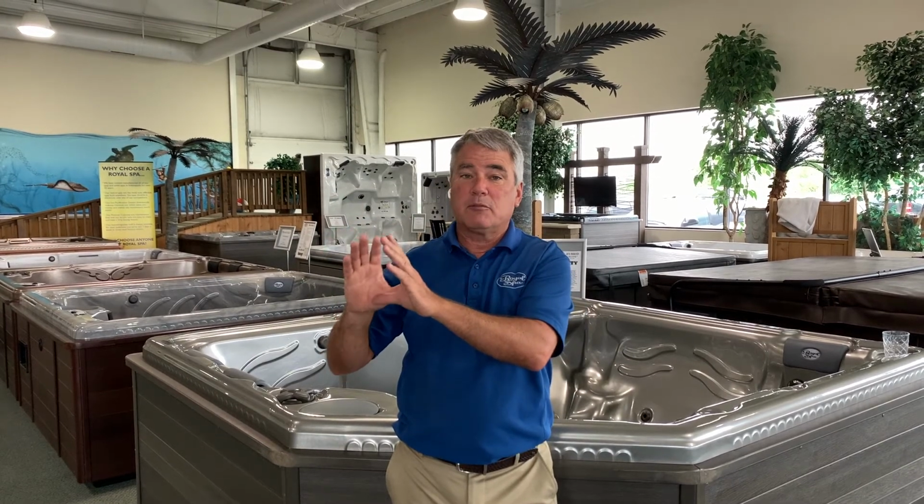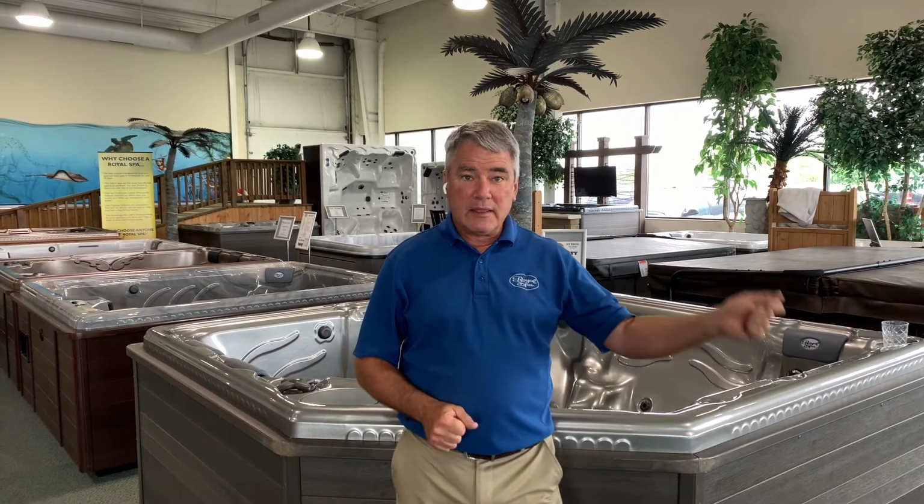Additionally, we're looking for a wire. We don't carry wire on our truck. So when we get there, we're looking for a disconnect box on the outside of your house that's been put in by someone that knows what they're doing. And that wire that comes out of there needs to be adequate to come from that disconnect box, travel at least 5 feet because the box cannot be within 5 feet of the water, and then it has to have enough length to reach where the pumping system will be when the hot tub is installed. So our guys are able to grab onto that wire and make the attachments inside the cabinet, but we're not allowed to go into your electrical box and we're not allowed to install the disconnect box. So we're hoping that that will be done when we get there.